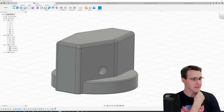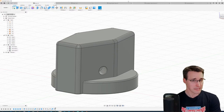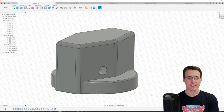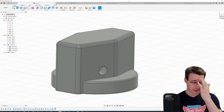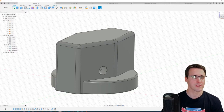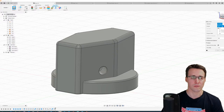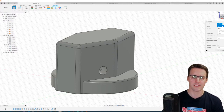How do you make an STL file? Ah, Dennis Lenner, yeah. I don't make STL files really for 3D printing. Also, I have read that STL files are not as good as 3MF files. I can show you when you want to use it in your printer. Then you go here to utilities and make. Fusion, some updates ago, already switched the default format value to 3MF. You can see here the 3MF, and this is the format that you should use.